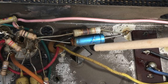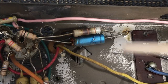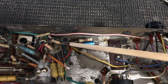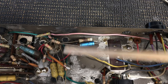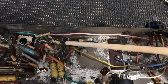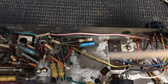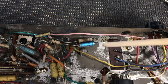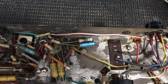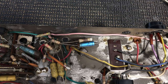Across the 150-ohm cathode resistor is a bypass capacitor of 100 microfarads. This capacitor is completely grungy — it's literally spilling its guts. So we may well have a short, or this capacitor may be partly shorting that part of the circuit. It wouldn't be a complete short because it is making noise, but it would contribute to excessive current draw. It would mess up the bias on this tube, probably creating excessive current draw, and of all the tubes on here this is the one that draws the most current — which could well be why that power transformer has seen quite a bit of abuse.